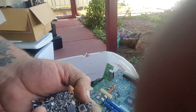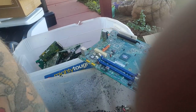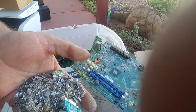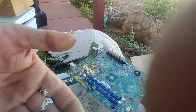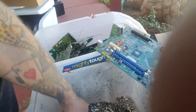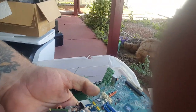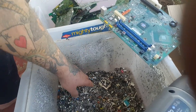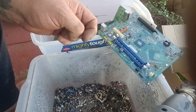I can't be bothered with it. I think the best way to treat this would be just to heat the whole lot up into a molten ball, make it into shot, and then treat it that way. I'm going to offer this for sale if anyone wants it — $10 a kilo, which isn't very much. You'll get a lot of silver from all the MLCCs, you'll get a lot of other metals as well, and then you'll also get some solder in decent pieces — which if you saw my other video, I used those to make stannous chloride. So if anybody wants some of this, $10 a kilo plus shipping. You really need a furnace to really cook it into a molten ball, then pour it into some water and make shot, and then just treat it with nitric acid.